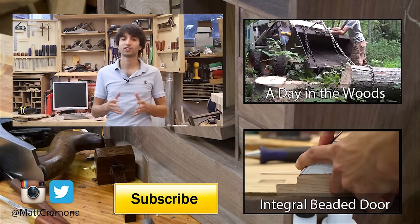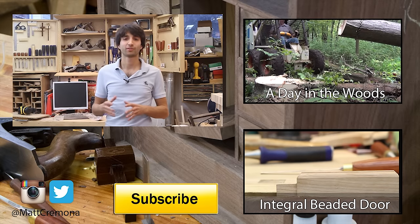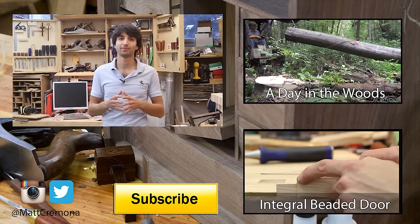I hope you found this useful, and I hope you can see how you can flatten things in your workshop given any kind of limitations you might have — maybe you don't have a jointer, maybe you don't have a planer, or maybe you have something too wide for either of your machines. That's also how most of those giant slab tables are made, using just a basic sled like this and a router. The one thing I really don't like about it is that there is no dust collection and this thing makes an absolute mess. Thanks for watching — if you have any questions or comments, please leave me a comment. Happy woodworking.